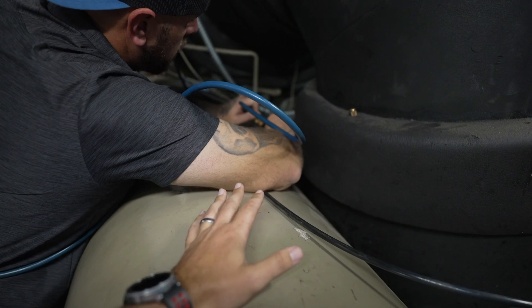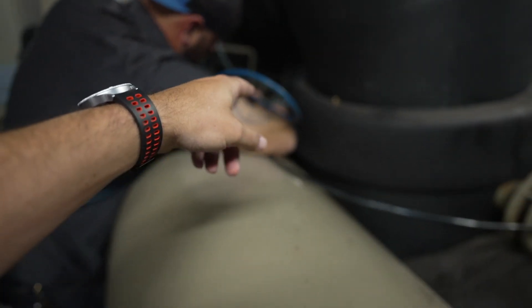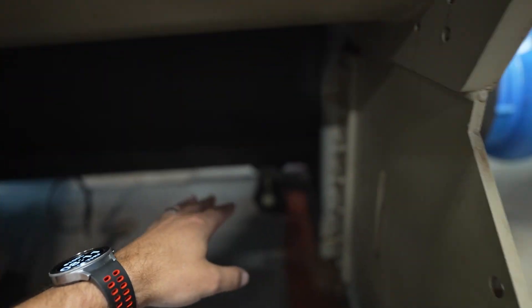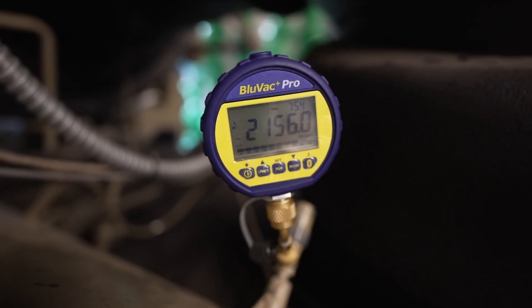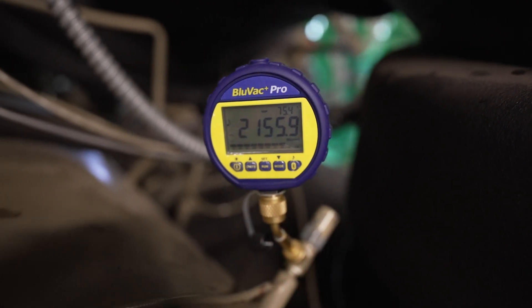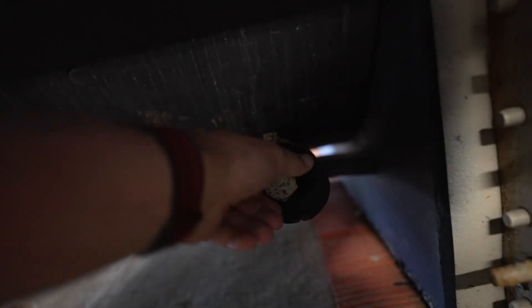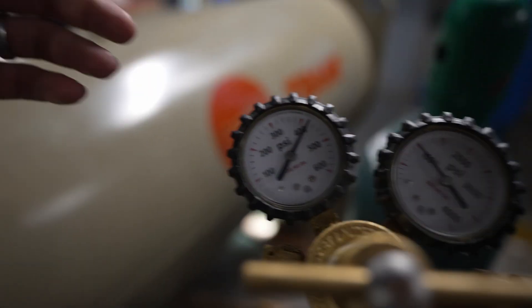With the clog finally cleared, we pulled the system down and by the next morning our goal of 350 microns was achieved. But four hours into our standing vacuum test we were up to 1,100 microns and climbing. I needed to determine whether this was a moisture issue or a leak, so I left the vacuum to sit overnight. By the next morning it had risen to 2,100 microns and stopped — which is actually a good sign. That tells us it's a moisture issue. I opened the drain port at the bottom of the evap to check for standing water and thankfully there was none.